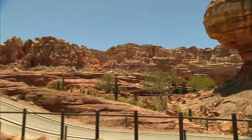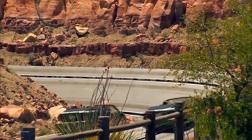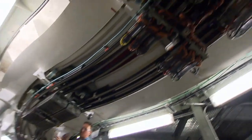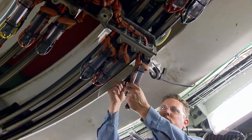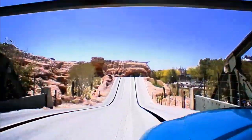Something that the guest might not think about is how do we get electricity to the vehicle? It's not like we plug in an extension cord. If you remember when you were little, you had slot cars — you put them on the track, they attach to the track, and that's how they got their electricity. Well, underneath the vehicle we have something called a collector shoe, and that's how we get electricity. The collector shoes are attached to the bus bar, and we inspect those to make sure they're okay, because without power, the vehicle's not going to go.